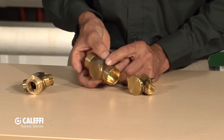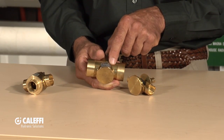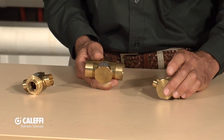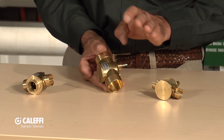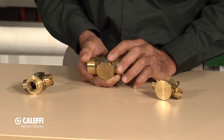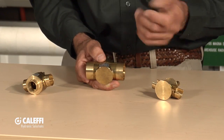Here's an example of our large inch-and-a-quarter sweat version. Notice there's a little tag on it. A couple things on the tag: the direction of flow going through it — A to B with a little arrow — so the flow has to come through in that direction or you're going to have a problem with the flapper not operating properly. Also on that tag it's going to have a CV number, which is the amount of GPMs that will flow through this valve with a one PSI pressure drop. We offer this valve in three different versions with different CV rates. If you need a higher shutoff pressure valve, it'll typically be a lower CV.